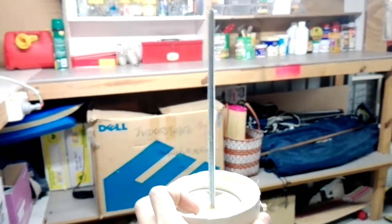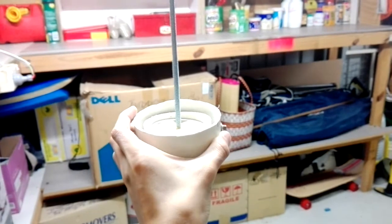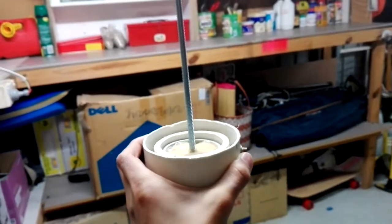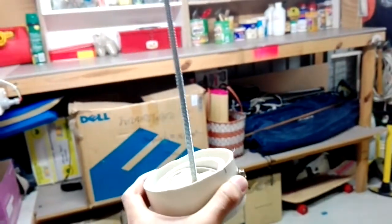You're going to have to put a block of wood there so it doesn't damage the camera, since these things are used for action shots. So just pretend there's a camera up there and there's going to be a weight down at the bottom. How it works is basically when you're holding anything you'll likely shake it, and because of the weight at the bottom it will counteract any shaking. Because of basic physics, objects will tend to do the easiest thing they can do, which is move between the axes. So as long as your axes move more freely than this thing moves side to side, you should have a very good camera stabilizer — we're going to add inertia to this thing so it doesn't move at all.